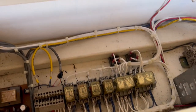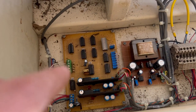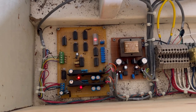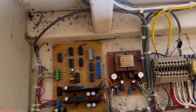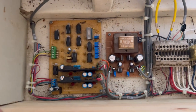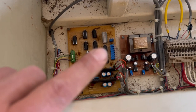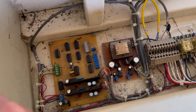There are also some logic relays in here. This little control board — I'll run the throttle up: one, two, three, four, five, six and seven. What that does is convert each one of those notches to a reference voltage, which I can adjust with these little potentiometers. Basically each throttle position has a fixed duty cycle per notch, and I can adjust that with those little potentiometers. Right now it's tweaked out pretty well and works fine.